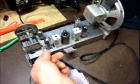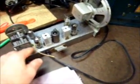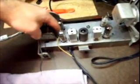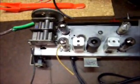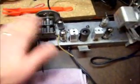And upon further inspection, I think what I'm going to do with this one is take this rectifier tube out right here, cut it back short, strip it, and splice the new wire in instead of messing with this solder joint on the side of the tuning condenser right there. I don't want to disturb that. That wire goes underneath the chassis, and I just don't want any heat anywhere near that.